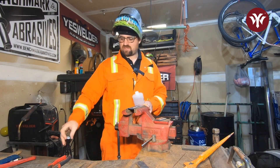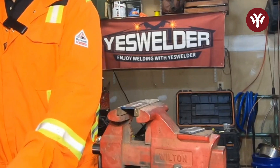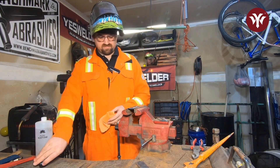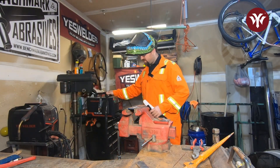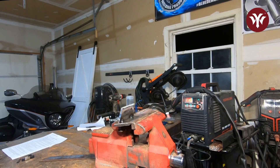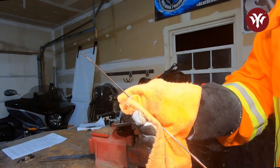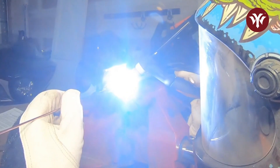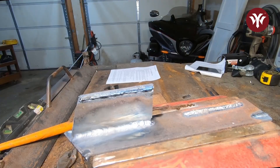Some of the sanding pad that wears off could lay on here, any dust in the air — stuff like that. The cleaner, the better. And that smells like glory. Those are two pieces of clean metal that I can now join into one. I'm going to fit this up, fire my TIG 200p back here, fit it up and weld it out again. It is also important to clean your filler metal off too, because your filler metal sitting by your bench will collect a lot of dust.